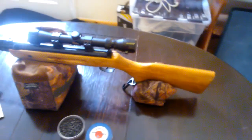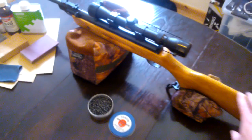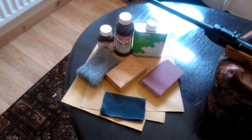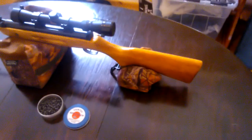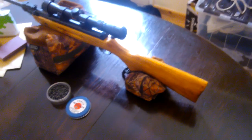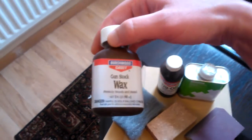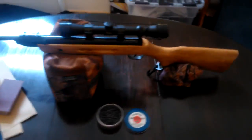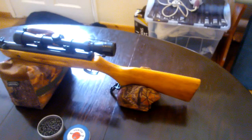Then you'll see it's got a nice shine to it, but if you look carefully at the stock there'll be bubbling all over it. So go over it at that point with some more wire wool and give it quite a good going over — you're probably going to take off about a tenth of a mil or less from the whole area of the rifle. It'll then have quite a matte finish — it won't look shiny anymore, but it will be very smooth. Once you've done that, to get the shine back, put some of this wax on — just smear it all on with gloves, leave it to dry for about ten minutes, then use a microfiber cloth and give it a good buffing, and you'll see it comes out looking like that.